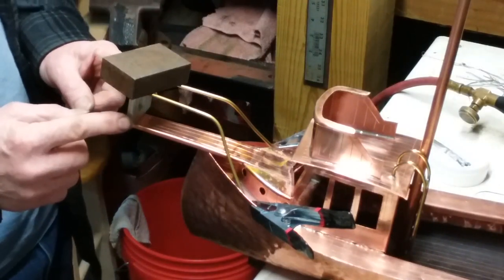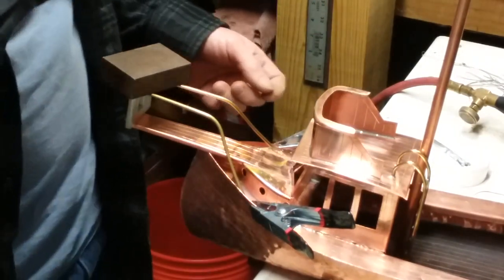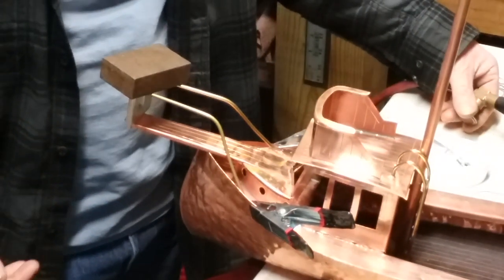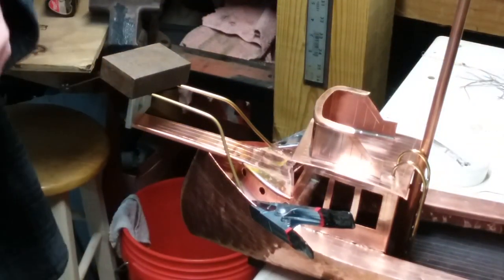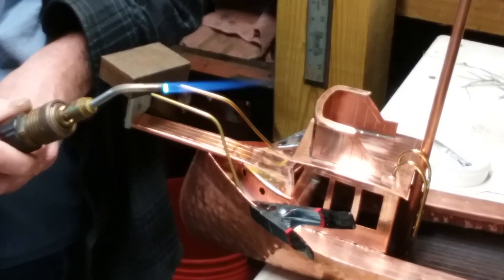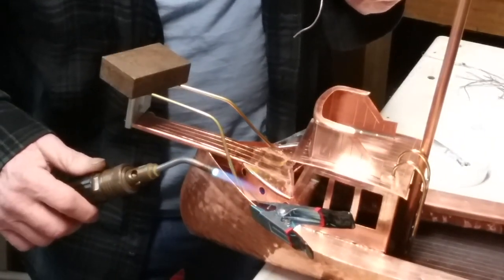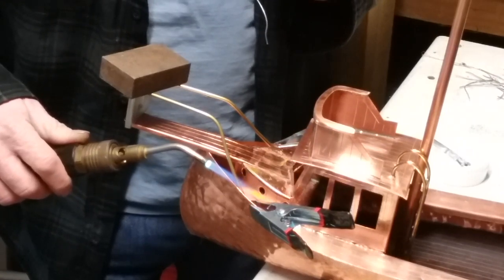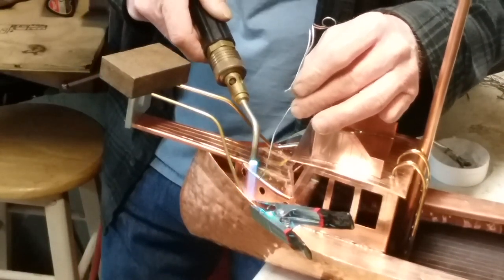Okay, I got a spacer in here and a weight on top holding that in place for this rod. I keep calling it a wire. It's brass rod. These clamps are like 50 cents or something, so as soon as I heat them, they may just lose their spring. All right. So again, I'm going to heat the thicker brass rod first, so the solder primarily gets to that rather than just flooding across the copper, which is easily heated. Now, I don't want to heat the copper side so much that something else falls off. It gets a little tricky as you start adding stuff.